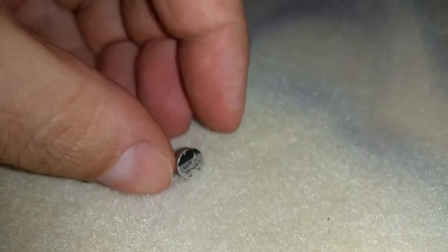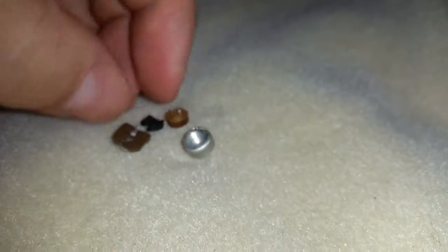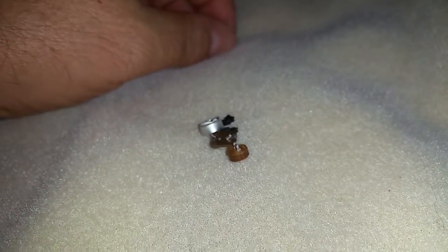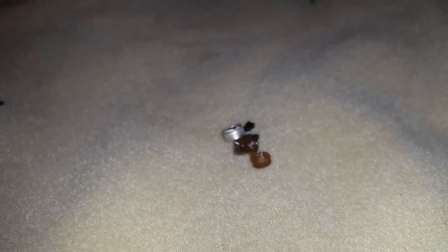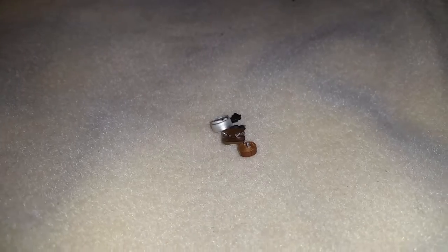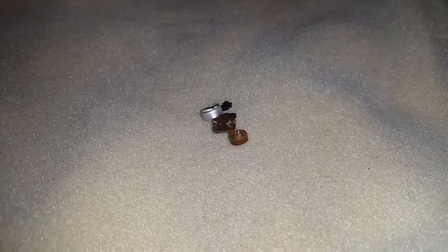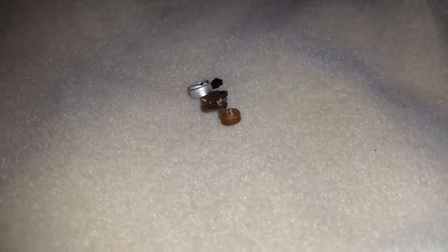So each one of those channels, you'll be able to see the value once you take them apart. Krell is sending me these caps fairly cheap actually, and schematics. You can do it yourself — you're probably looking at about 30 bucks. There are three caps per amp, but that's the problem if you have a playback issue when it's distorting throughout each channel the same at all levels of volume. Hope that helps, any questions let me know.